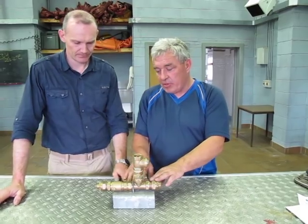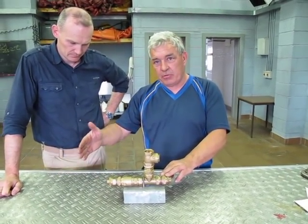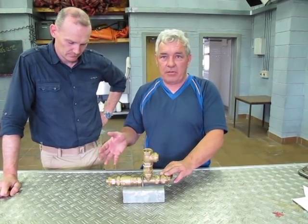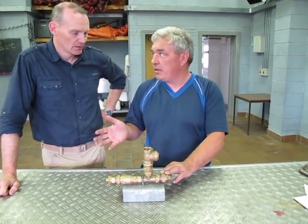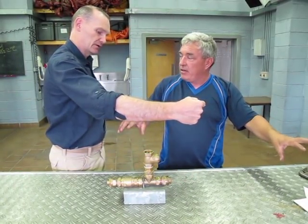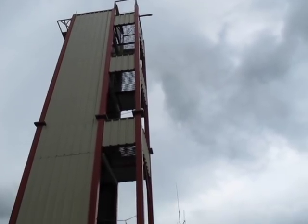With this demo pump we can actually build the static pressure on this side up to 100 psi, which will take water over long distances. At the moment we're pumping out to 50 feet outside from a four-foot head on this side, pumping to 50 feet on the training tower here at First Nation.